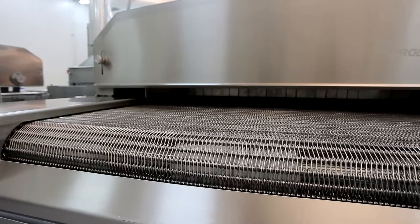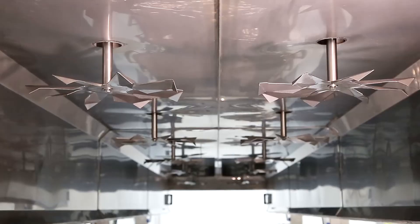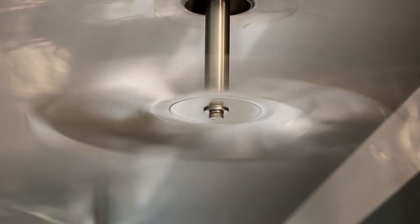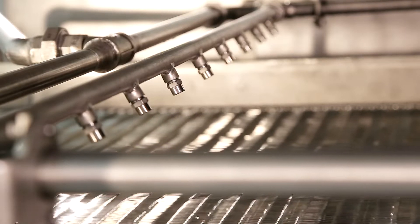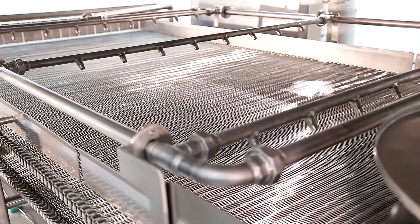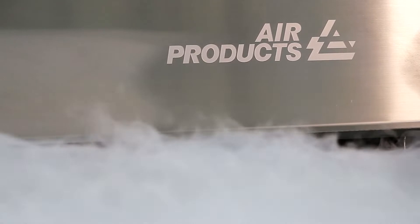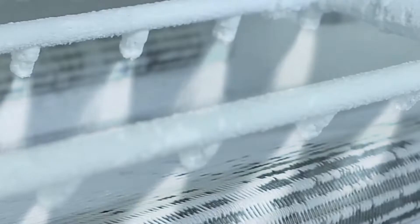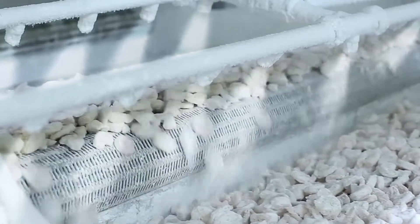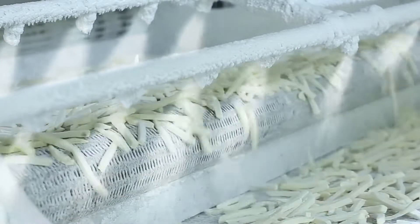The FreshLine EAF Freezer is designed with simplicity and reliability in mind. The specially designed fans disperse the vaporized liquid nitrogen throughout the tunnel for optimal efficiency, ensuring a high-performance spray-freezing operation. The extremely cold liquid nitrogen brings consistent and reliable high-quality results. Depending on your needs, products can be crust-frozen within seconds or frozen within minutes, instantly retaining their taste, texture, and moisture level.